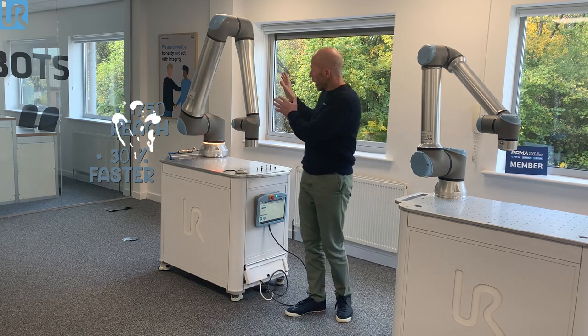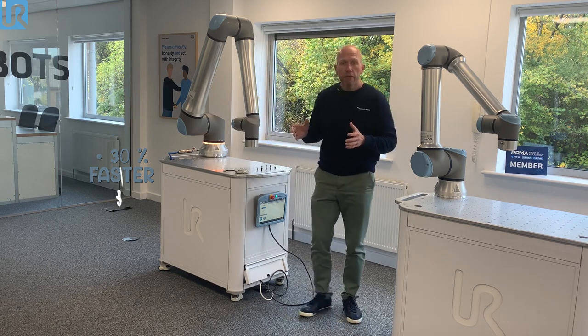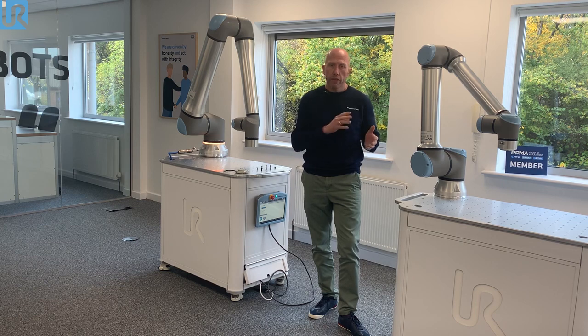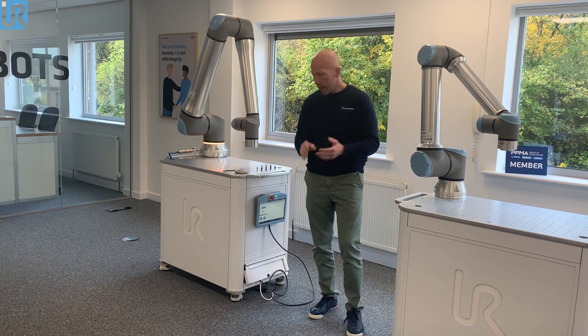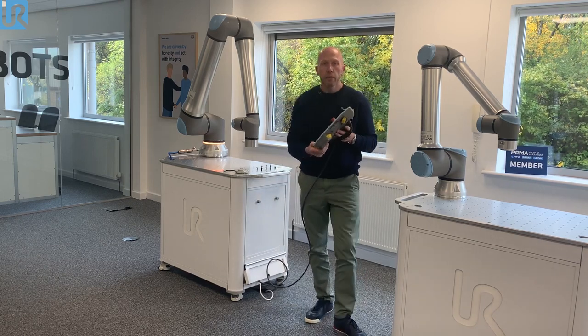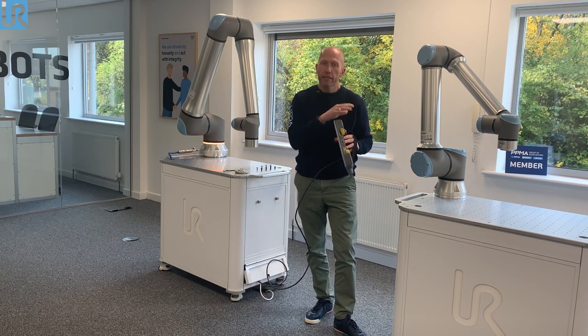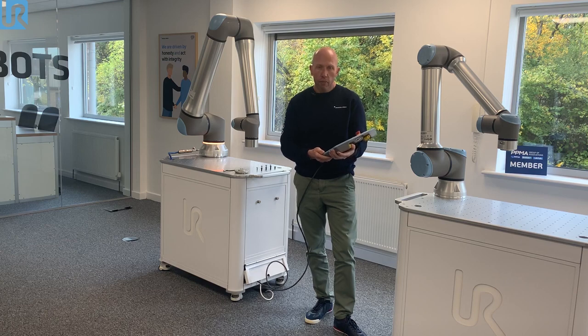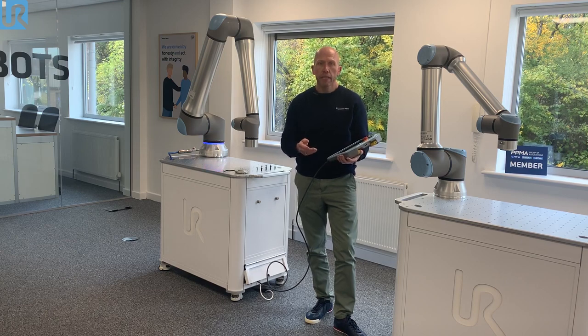What you actually get in the box is the UR20, and it runs the same controller as the E-Series. What's really cool is it actually runs the same software as well, so if you're used to programming the E-Series you're going to adapt to this robot very quickly. One of the key differences is it actually gets shipped with a 3PE teach pendant, whereas on E-Series that is an option, so to manually move the robot we need to use the 3PE switch.